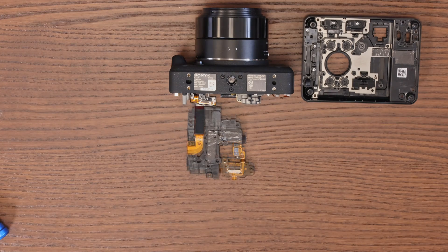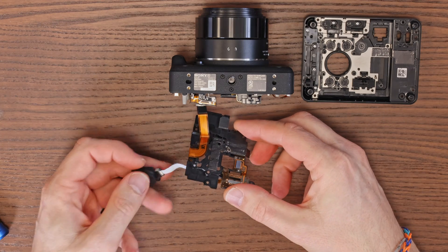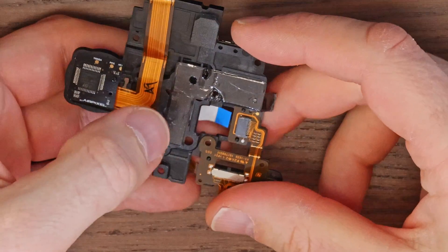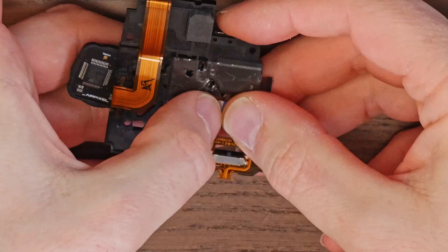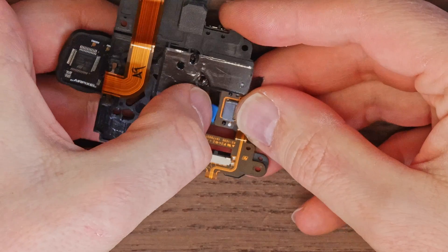Now prepare the LR1 expander, which we will connect to the rotary controller connector. The connection must be made directly along the axis of the connector, and caution must be exercised — pressure on the flat cable should only be applied at the point reinforced with plastic reinforcement.